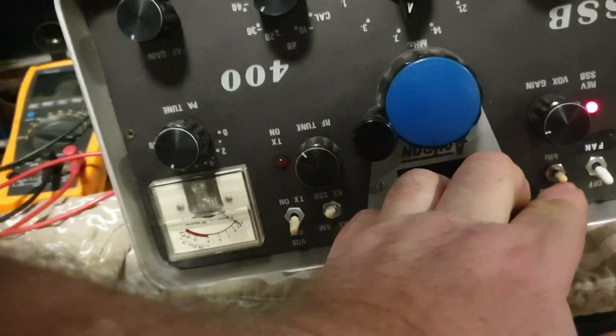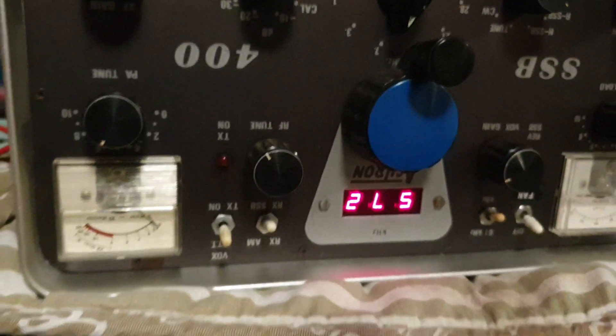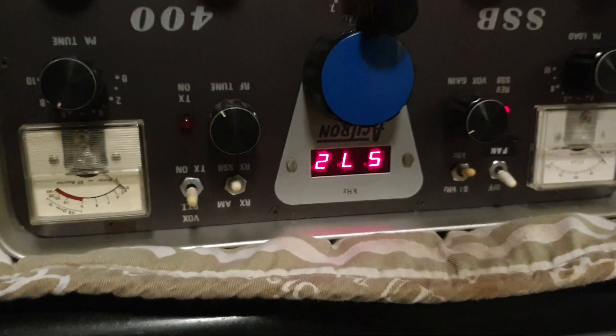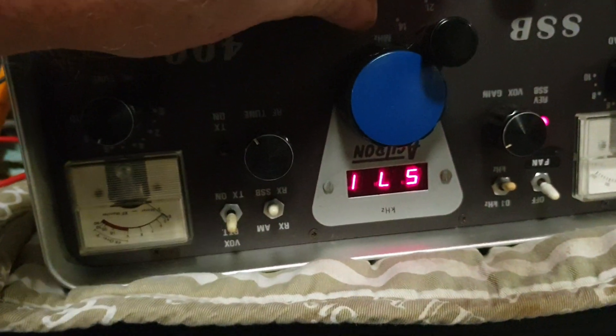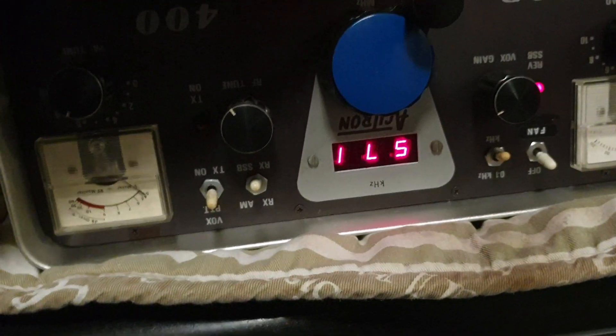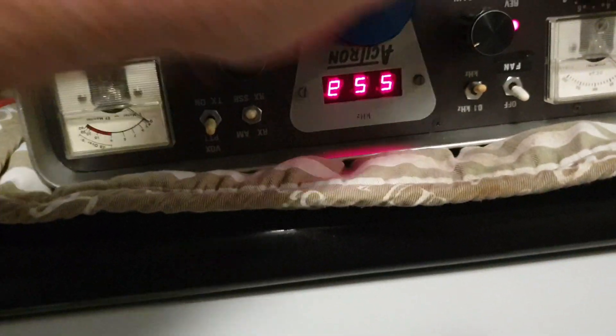The display is off and I can hear it cycling again. My thoughts are it's probably not locking completely at the moment, although this isn't really a PLL system — it's a crystal-based oscillator system. So something's free-running in there, and you've got to start thinking a little bit more old-school.